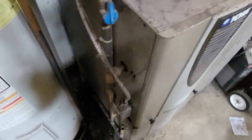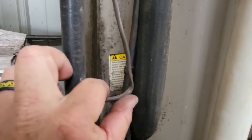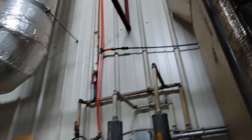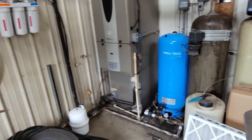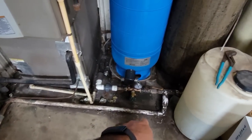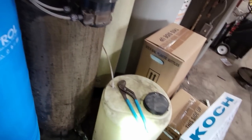Let's go ahead and turn that off, open this thing up, and see what kind of metering device it's got. Let's see if we got a leak in the evaporator - see this dark stuff here. I have a feeling this right here is a fancy water treatment system for people that have sulfur water. I've mentioned that before - sulfur water eats into coils. Notice how everything is run in plastic. See this little line with a hose - that's injecting hydrogen peroxide.